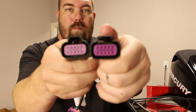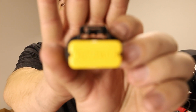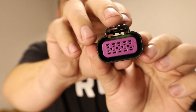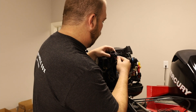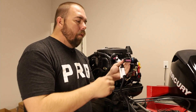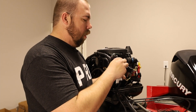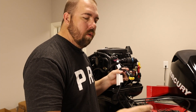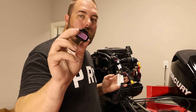You can see how they match in orientation, and this one literally says 'terminator' on it. That's what this one looks like, and then the one for the VesselView looks just like that — so this should be real easy. We're going to go ahead and plug her on in. She clicked real nice and easy. So don't forget we've got to remove the weather cap. We plug the terminator in where the weather cap goes. Save this — you might need it later. If you change motors or need to store your VesselView for a while, save your weather cap.